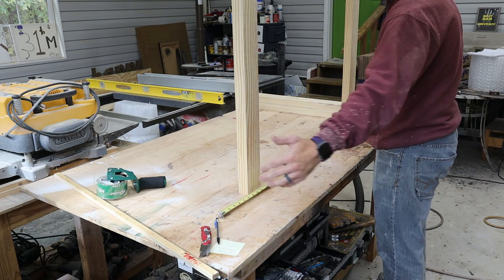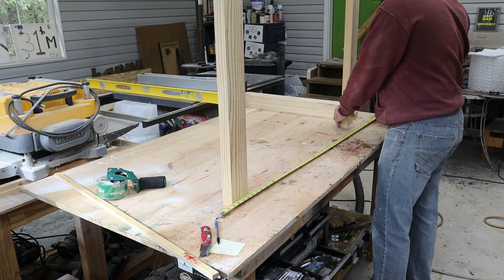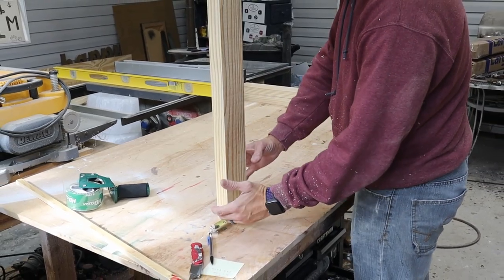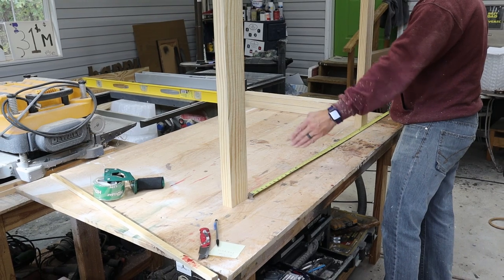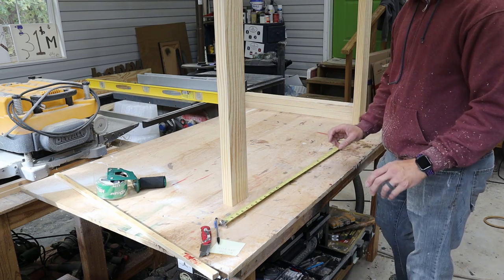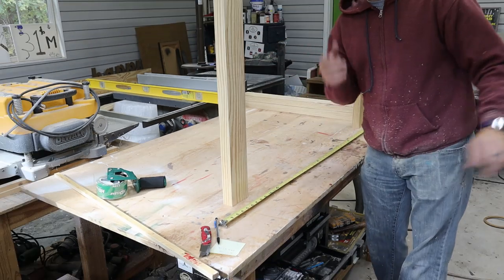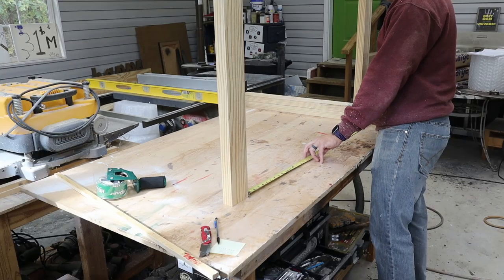If I know I want my table top 50 inches and I want a little overhang on each end — let's say three inch overhang — the easiest way is to line these boards up, pretend the table is upside down. This is your leg at the bottom, measure in three inches, lay your tape measure there, put this leg at three inches, put this one at 47, then measure from there to there — that gives me 37 and 3/8 inches for what the runner will be. I want two by two runners around the top — stretchers, rails, whatever you want to call them — all around the top, and then a two by two on the bottom for the bottom shelf. I'll cut those out of extra two by four material. I know I'm going to need two of them at 37 and 3/8.